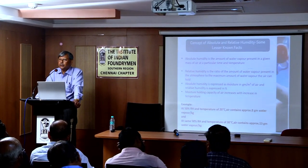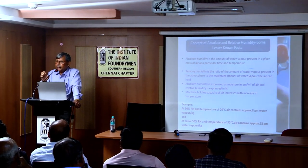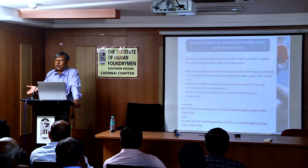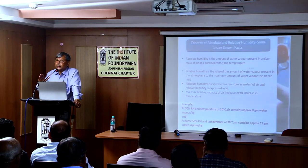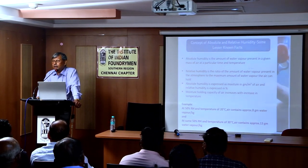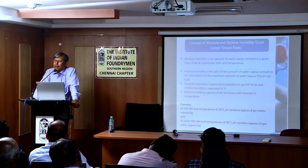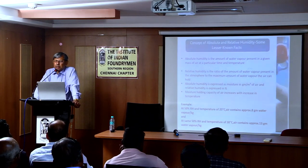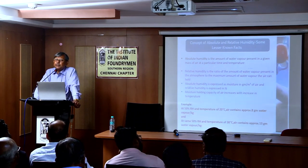Then what is the solution? Whatever tests we carry out in our laboratory are only up to releasing from the pattern, handling and closing. Pouring strength is something different; it is a hot strength. So if you are sure that with a particular strength, suppose 80 psi tensile, you can handle and close it, why do you ask for 150? Because most of the time, the higher the immediate strength, the lower the strength that follows. So my request is to be practical and sit with the supplier also, and let us sort out these issues. This is a perennial problem associated with the specification and the supply.